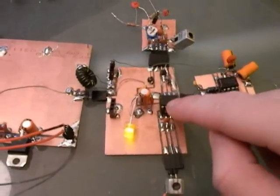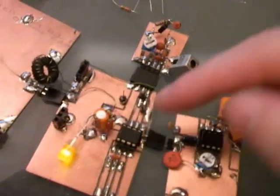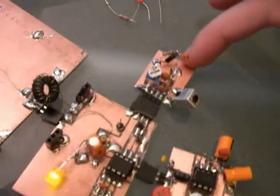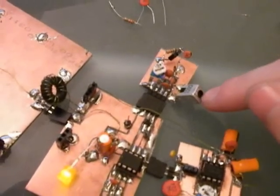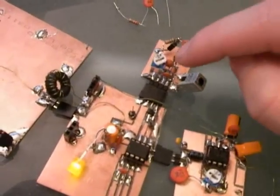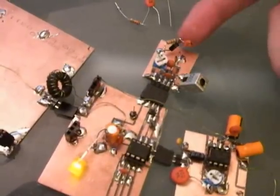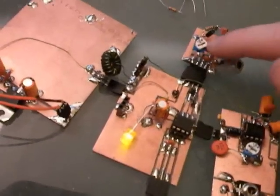It's going into this microchip where it's mixing the RF from the antenna with the local oscillator. And the oscillator is mostly circuitry built into this chip. However, it uses some external circuitry to determine the frequency. That's a handful of capacitors and a variable inductor that I have here. I fine-tune frequency using a varactor diode. It's just a rectifier diode which I can push voltage against backwards to adjust capacitance by turning this potentiometer.